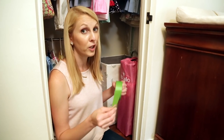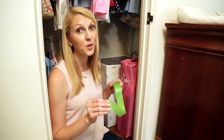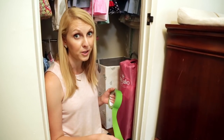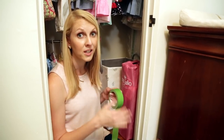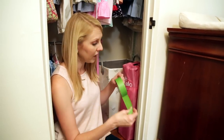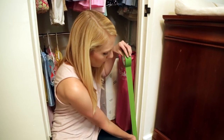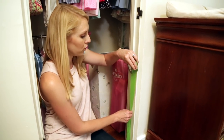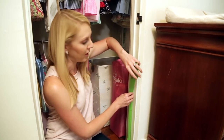My last trick involves painter's tape. Even though your door may be dry to the touch, it isn't fully cured for a few more hours. So in order to be able to hang it and close it, all you have to do is apply painter's tape to your door jamb, and that'll keep your fresh paint job from sticking to the paint on your door jamb and ruining your new door paint.